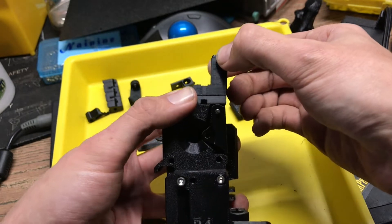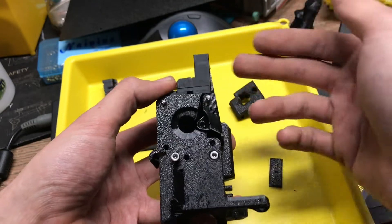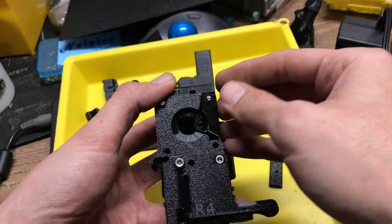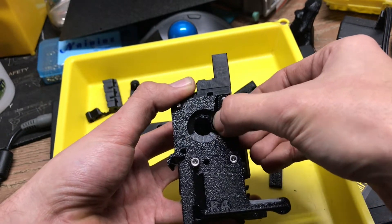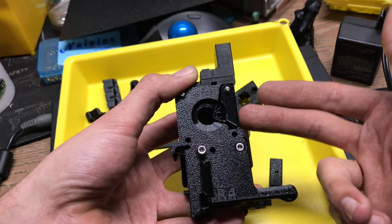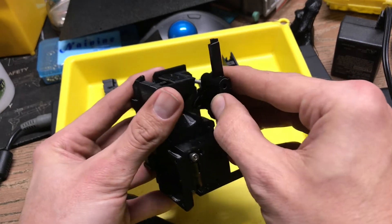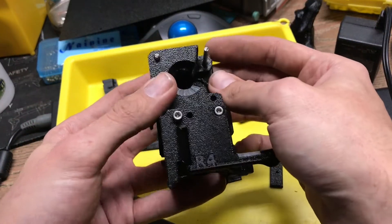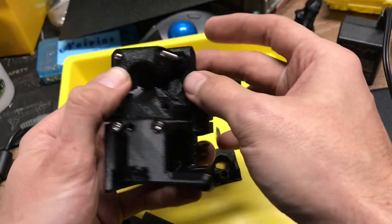What does this mean? What I predict is that they're going to be making an auto-calibrate for the MMU. One of the issues before was that unless it's perfectly calibrated, you get a little bit of grinding on the back end while filament is caught by the Bondtech drive gears. By being able to detect via door deflection when the filament enters, the machine will know interactively when filament loaded from the MMU hits the drive gears. That's what these parts are for. I think with updated firmware they'll add an auto-calibration routine — though that remains to be seen and is basically speculation. Still, I can see how these things go together and can tell what they're going for. The question is whether they'll add that firmware piece for the auto-tune.